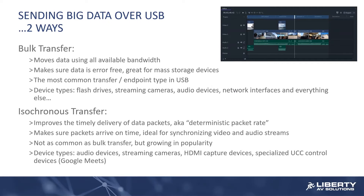Yeah, that's actually a very good point. I do have some information here on power delivery. I do usually make a passing comment that in the pre-power delivery days before Type-C, all the USB versions had their own power specifications. Battery charging spec 1.2 goes up to seven and a half watts. But the point was that everybody abused those power specs. The laptop manufacturers, the PC vendors were only required to provide 500 milliamps of output current at best on these ports. But it's obviously not uncommon to see one and a quarter amp type power demands on some of our devices, including cameras.